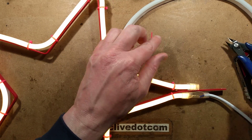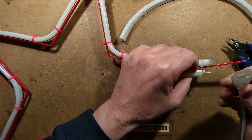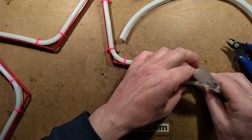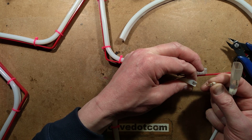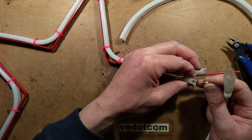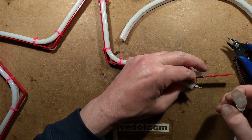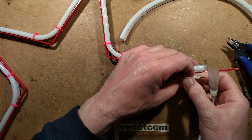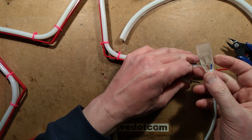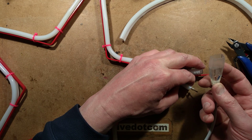So that's the star complete. Things worthy of note about the termination: the end cap pushes on and you've got a set of spikes that go in — this is very common for this type of linear LED stuff. You've got little bus bars in there and you push the spikes into those bus bars. In this case the positive goes to the back and the negative goes to the front of the diffused area.